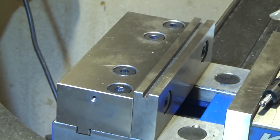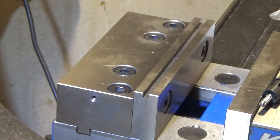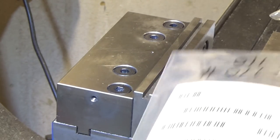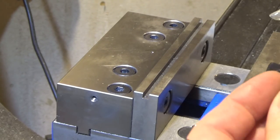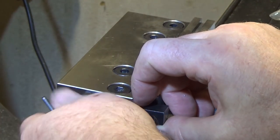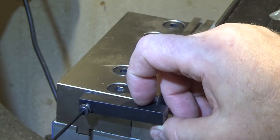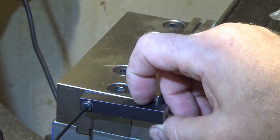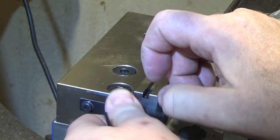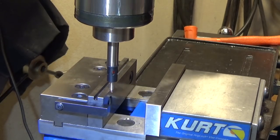I might go for a slightly smaller washer — the 60 to 110 pounds one is a pretty small washer. By the way, I got these at McMaster-Carr; they were about 50 cents each. They're not cheap but very useful, especially in situations with a lot of vibration where you don't want threads to back out, since they keep constant tension on the threads. There's plenty of friction, so we're going to Loctite this in place and we should be done.